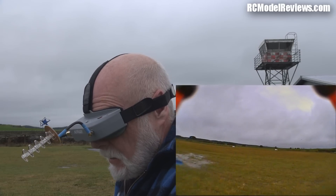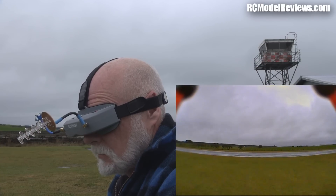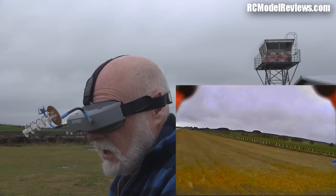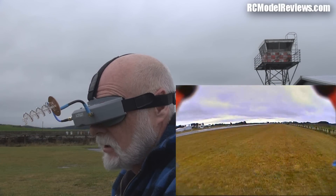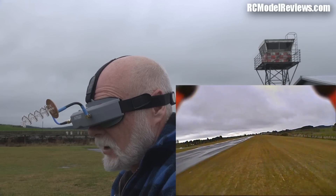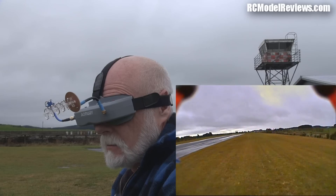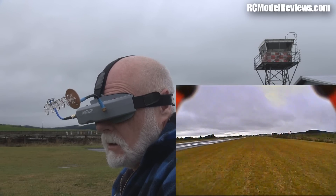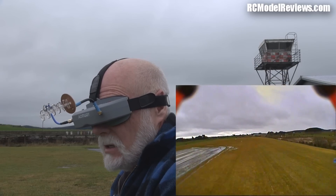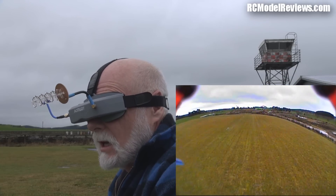Let's go back out where we went before. Days like this are actually not too good for 5.8 GHz - moisture in the air can knock down the range quite a bit. I'm keeping low, well within the Fresnel zone, so it's a good check for multi-pathing. Staying nice and low - this is probably 500 meters. The birds - can't miss the opportunity to give some birds a hard time.